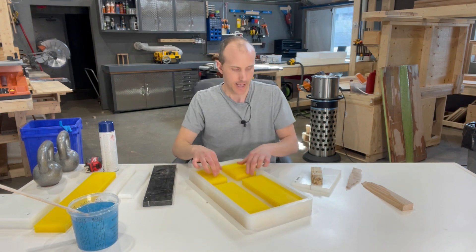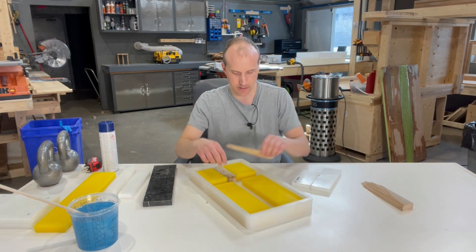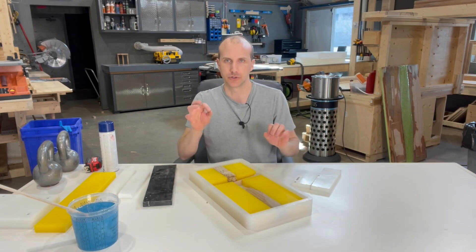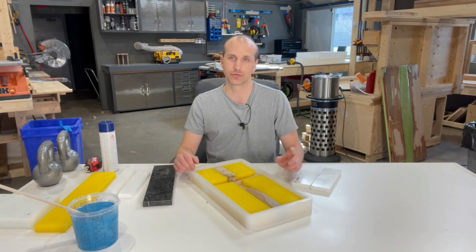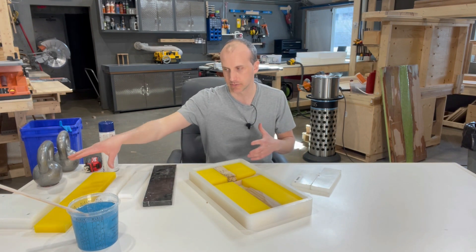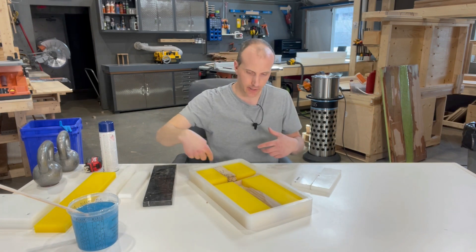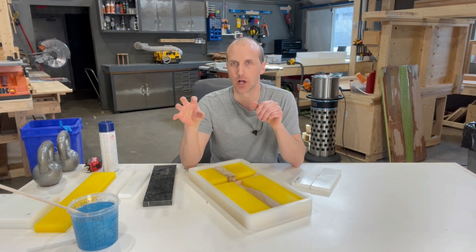There you go — you can probably see that in the video. My wood, which I think is two inches, I've left a two inch gap universally, and I can just insert it in here. I've broken the wood intentionally because I wanted to see the natural broken sections through the resin. When I tinted my resin I used just a little bit of pigment so it's still a bit see-through. I'm going to pour my resin in here, let it set, and effectively create a cross with this rectangular mold just by using the HTP spacer blocks. You can also cut shapes like curves out of HTP for unlimited options.